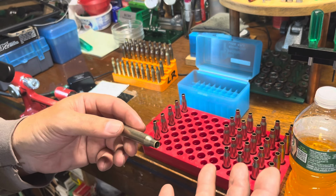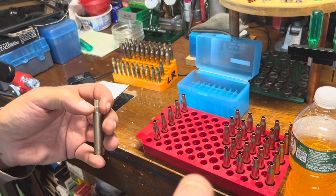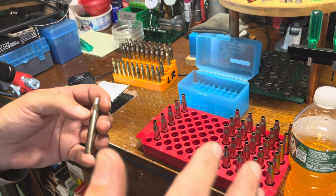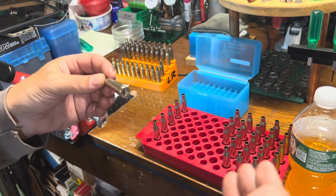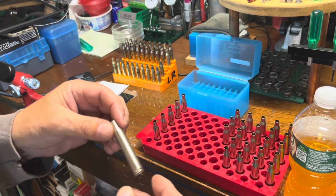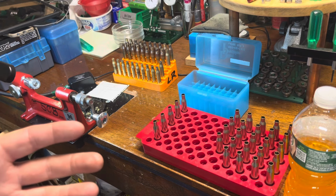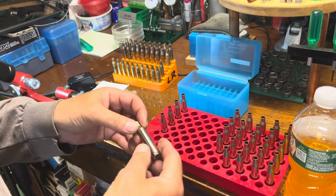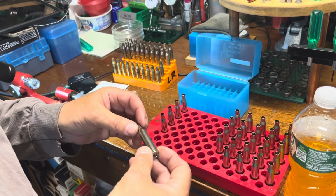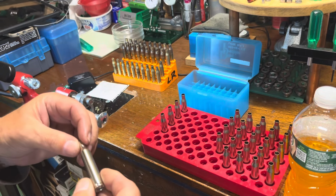That's necking up 3006. And brass was available just a short time after I did it, because '87 or '88 was the year Remington legitimized the 35 Whelen. So brass and reloads and loaded ammo were available. I know I have some new brass that I bought then, because I remember buying like 5 boxes to have factory brass head stamped shortly after I made that rifle. This one here, A-Square did legitimize it, but I never really looked hard to buy their brass. Probably Starline making it for them, I don't know.